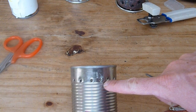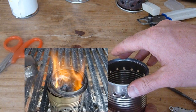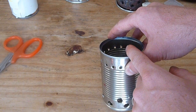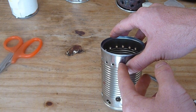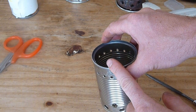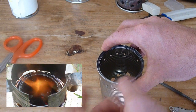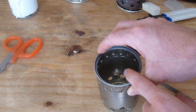This upper ring is actually going to inject hot air in at the top. Normally in a stove you get heat coming from the sides and top of the fire, and there are a lot of unburnt gases at the top — that's why they have afterburners. They have high efficiency wood stoves for houses nowadays. Well, this is essentially the same thing but a lot more compact. You're adding more hot air right at the top, and I'll put a little video at the side showing the jets and the flames coming actually from these points in the stove more than anywhere else.